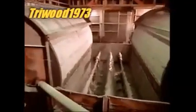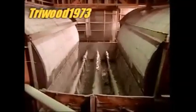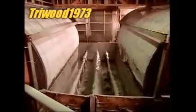Workers transfer the wet solids to an agitation tank and blow in air. The oxygen sets off a chemical reaction between the cyanide and the gold trapped in the ore, triggering the gold to dissolve and leach into the surrounding water. Drum filters then separate the water from the solids.